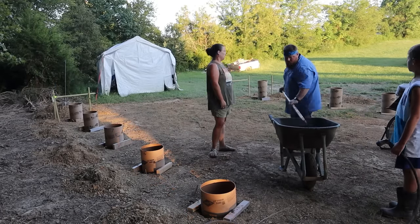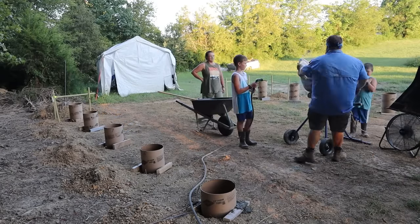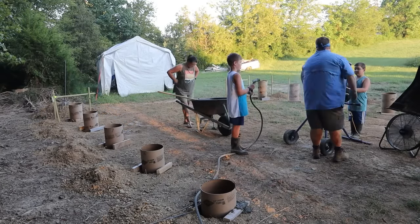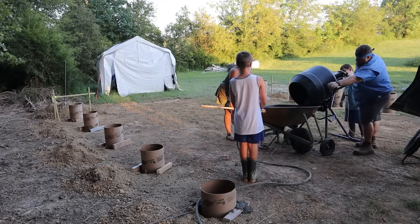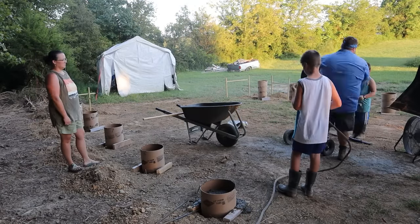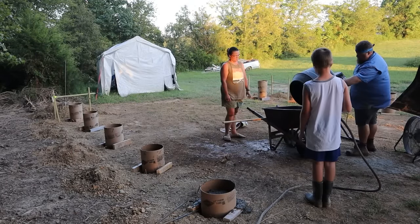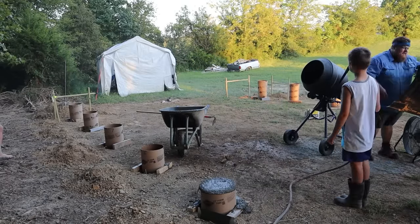It's also worth mentioning, I don't believe I go into details in the video, but we are putting rebar in every single one of these footers and pier pours. Anywhere from 2 to 4 sticks of half inch diameter rebar gets put in, depending upon the height and length. So while I don't cover it in detail, there is absolutely rebar placed in every single one of these. It's just one of those things that I got busy and forgot to do a really in-depth show and tell on.